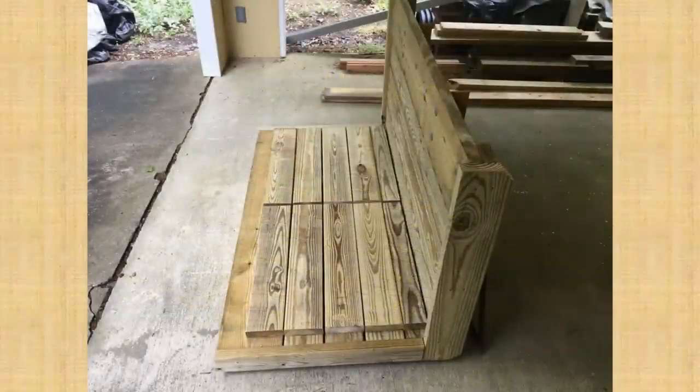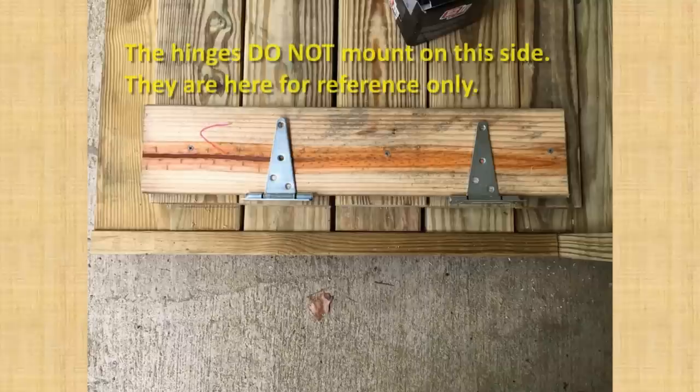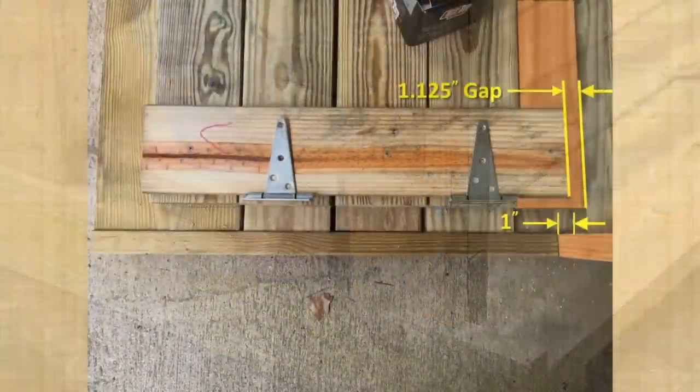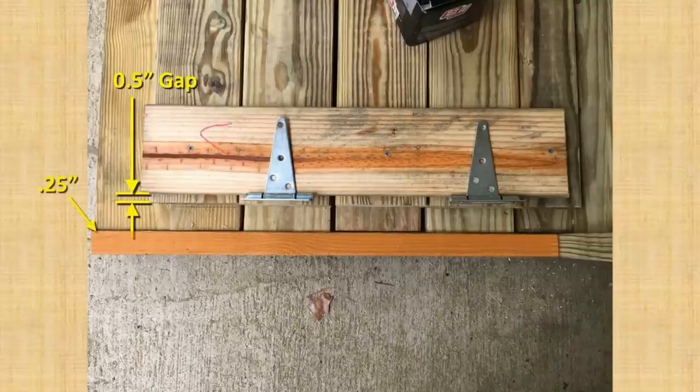There's a quarter-inch gap between the side panel boards to allow for swelling. The side panel boards are tied together with pieces of 1x6 deck boards. Note that the hinges do not mount on this side of the panel — they were sitting there for reference only. While the deck board pieces are flush with the top of the side panel, they're about an inch and an eighth shorter at the bottom to clear the 1-inch tall side of the platform boards. There's also a half-inch gap from the edge of the side panel boards to ensure enough clearance from the side 2x4s of the back boards.